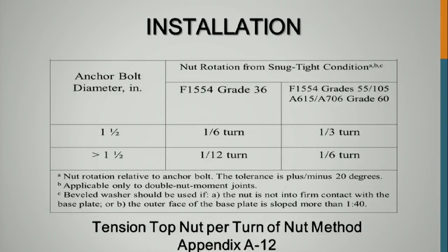Both of our wrenches, this is one for a smaller diameter. The head on this one, the square end started here and went down to about my hand. This is a smaller diameter slugger wrench. And the way you use them, you put it on the bolt, and you have your buddy hold his foot on the wrench. You hit the wrench handle with the 10-pound sledgehammer while your buddy's standing on the head of the wrench. That way you don't hit your own foot.